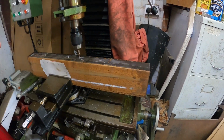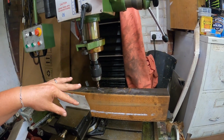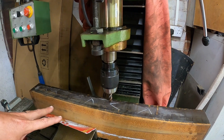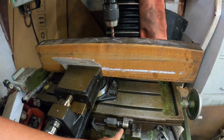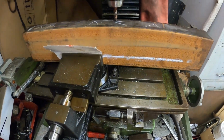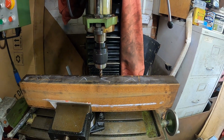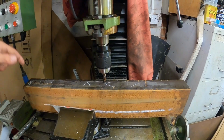Got my pieces of metal now to do the forklift frame to make the carriage plate fit to the 3-point hitch on the tractor. So what I've done is I have set it up in the milling machine, as you can see. Got a roughing out bit, I've set the automatic stop on the auto traverse so it'll always stop in the same position, and now I can do 1.5 mil cuts. So this is nice and easy. I can do 7 passes at 1.5 mil. That'll take me through to my 10 mil thickness for the wall.